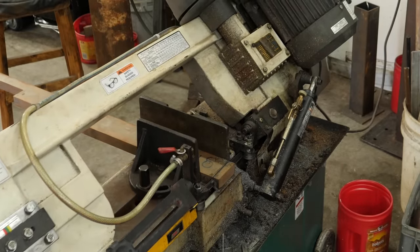I'm just not happy with how this is coming out. I want to get it really nice looking since the customer is going to be able to take the handle apart and see the inside. So I thought I'd try to pry the handle apart and see how well the epoxy is holding. I had to pry on that really hard — wow. The epoxy held really, really well. It actually peeled layers of the carbon fiber off a little bit. I'm going to clean up all these pieces and think about putting them back together without remaking the frame.